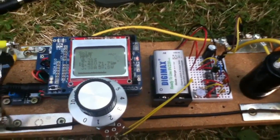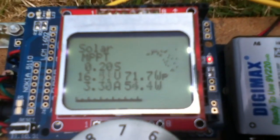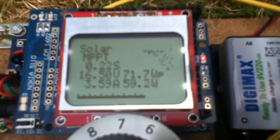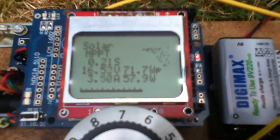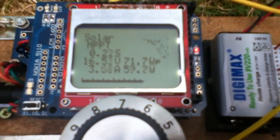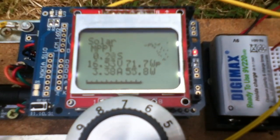I'm going to have to think carefully about how to remove the noise. It may just be a case of using digital filtering techniques. I have put a very simple first stage of averaging into the current reading, and it did calm it down a little bit, but it also introduces delays and has negative effects. So I might look at other digital filtering techniques — there are some filtering systems based on median and mode and other statistical filtering techniques which may be possible to employ.